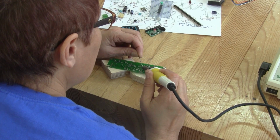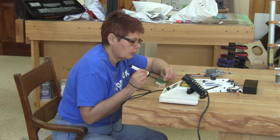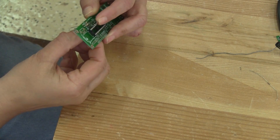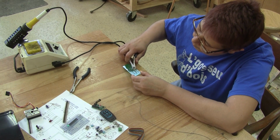First thing René has to solder is the microcontroller's socket. I make her solder all the parts according to their complexity and height. So after the socket, she solders all the resistors. She passes the wire through the hole, solders them, and cuts the wire's excess.